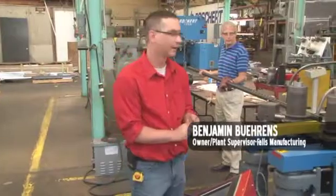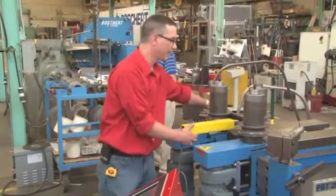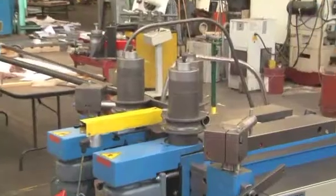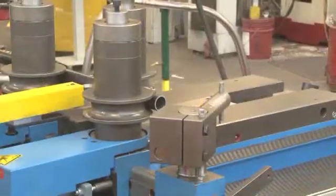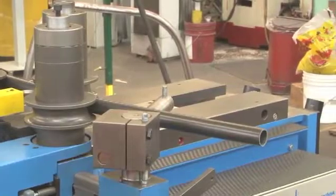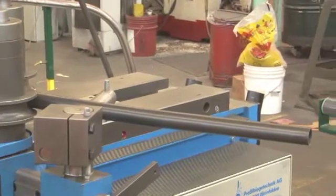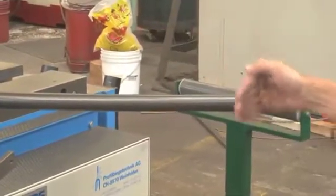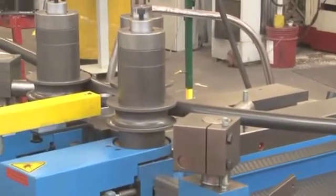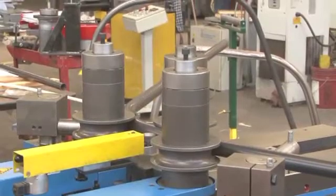At this point we're going to set up the machine and get it ready to bend. We have all roller heights set. We're going to pull out the Y-axis, feed the part in just past center of the outboard roller, and start the machine. The Y-axis feed speed is variable: when in a bend the machine goes slower; in a larger radius or a straight section it goes much faster. When the center roll is applying bending force it slows in the Y-axis, then speeds up as it progresses through the bend. All of this is calculated automatically by the control.